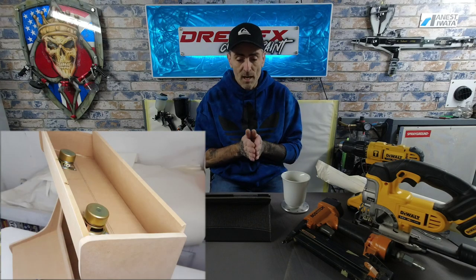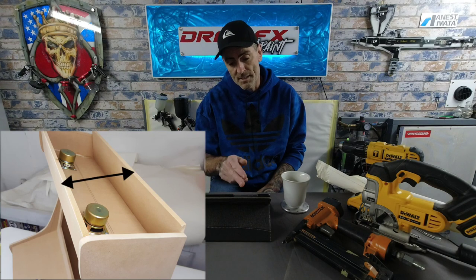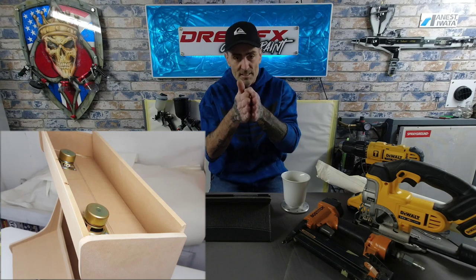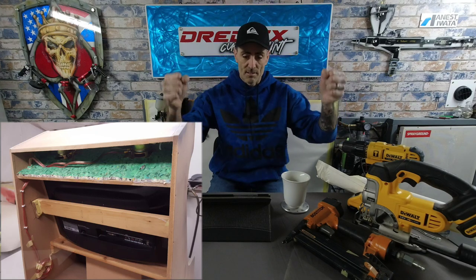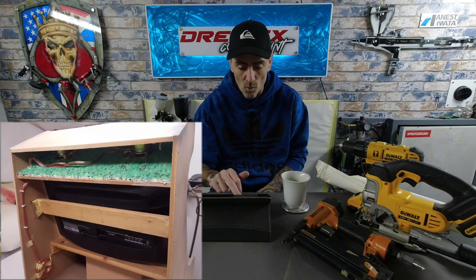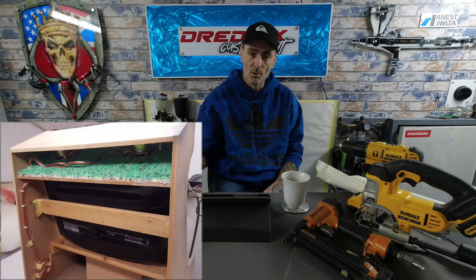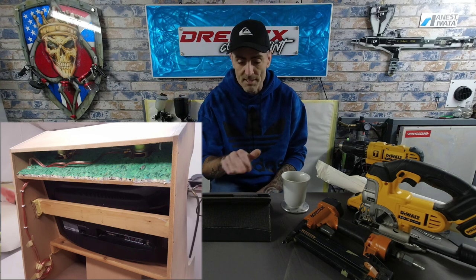The speakers are about 3 inches, so you're looking at an overhang gap of about 5 inches with the round speaker grills. The top of the cabinet is a box: about 6 to 7 inches from the front face, with the two speakers inside, and then the backboard about 8 inches depth going back. The TV is held in place with a batten across the inside and a brace angled across the back. Wires go up the side into the speaker area, with a piece of underlay foam stapled in.